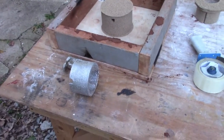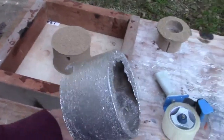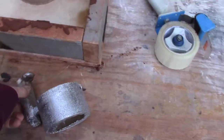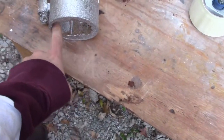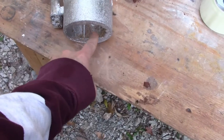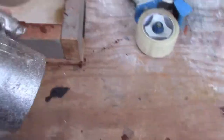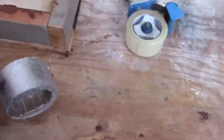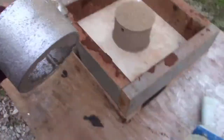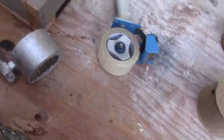Okay, today we are going to be casting some lights for a Model-T Go Kart, and basically what our problem has been is that we've been short shooting. It hasn't been filling in, and I've been doing some research, and part of it is that this lens part is way too thin, and as you can see, I also have some blowouts on the backside, but I think that's contributed to the fact by... it should have filled because that's near this bar, near the pouring area.